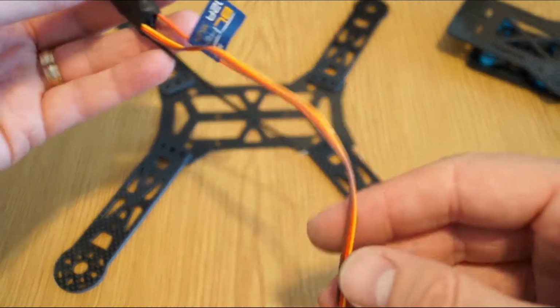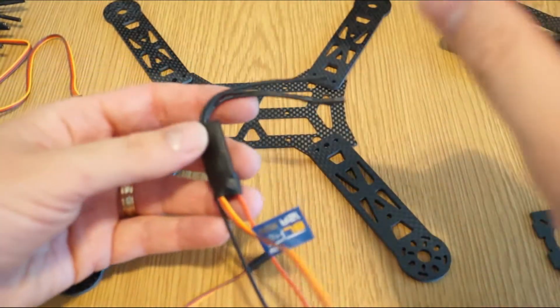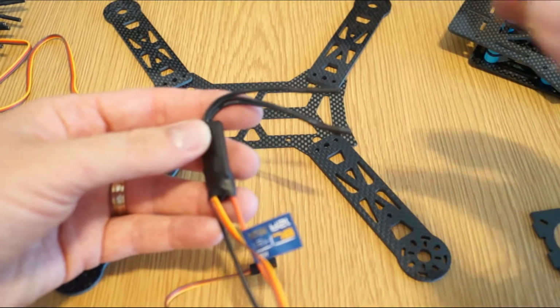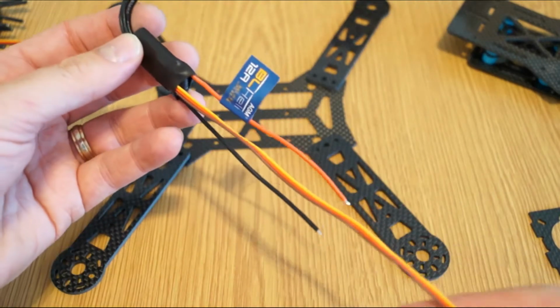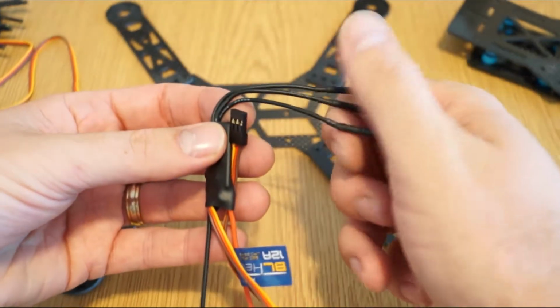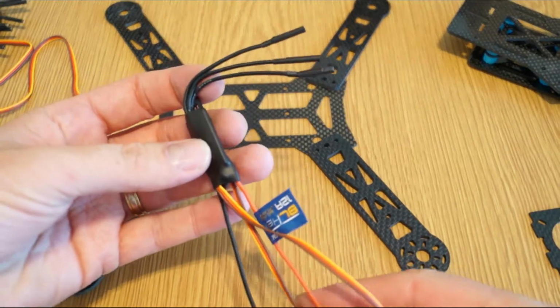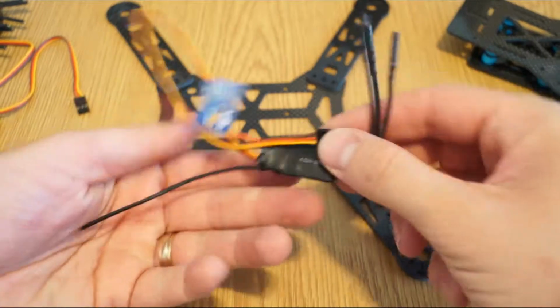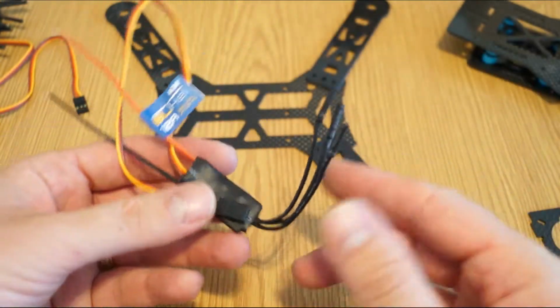So just be careful. Use just quick touching with the soldering iron. When you get to the right temperature, apply the solder to make the contact, and then cool it off quickly. So don't keep the tip of the iron on it too much, because you could damage it.